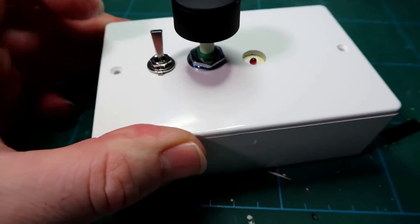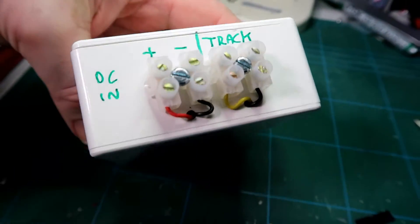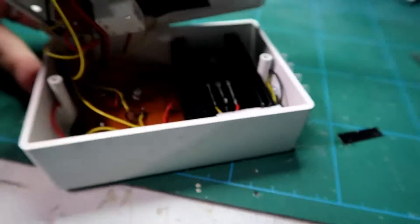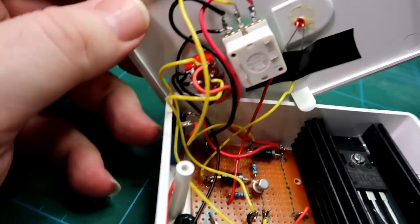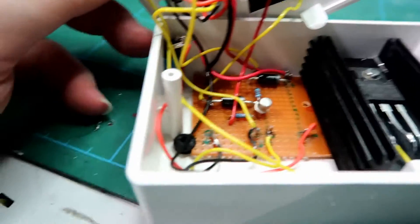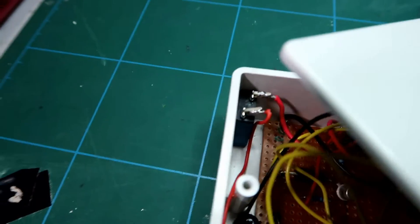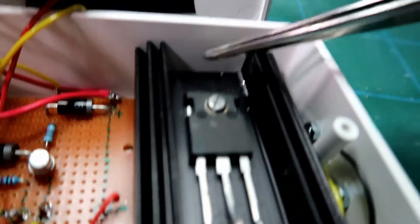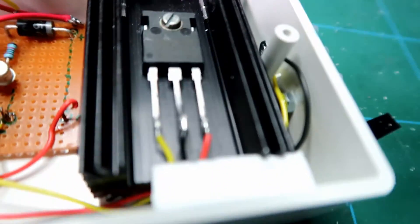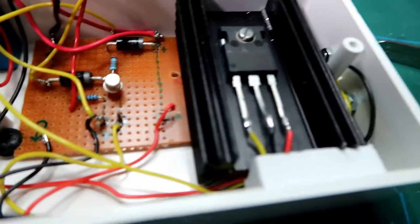Hi everyone. It's the only small box I had and it's fairly compact in there as you can see, and the wiring is really a mess I think, but it is all there. We've got the self-trip fuse over in that corner, the little PCB is held down with that little grommet there and it's trapped underneath the heatsink. The heatsink has its pins through the plastic body there and it's held in place by that bit of rubber, which keeps all the wires neat that go to the outputs and inputs.